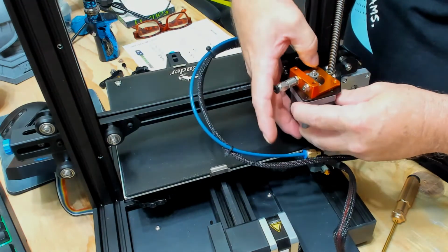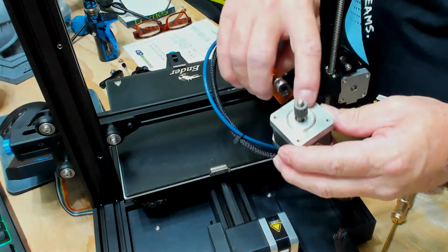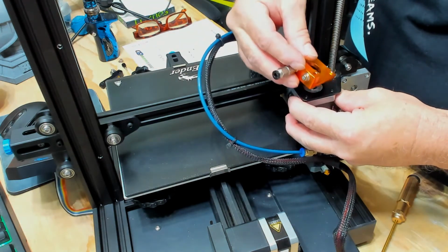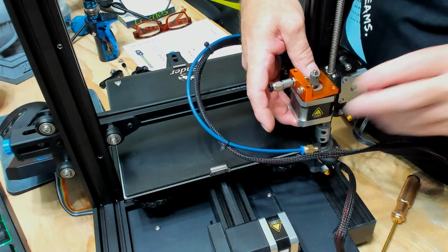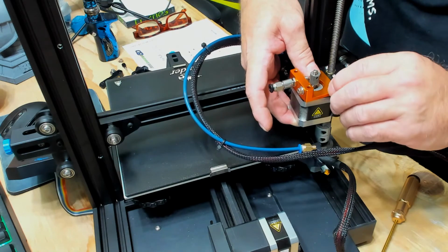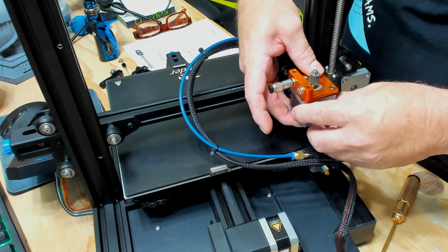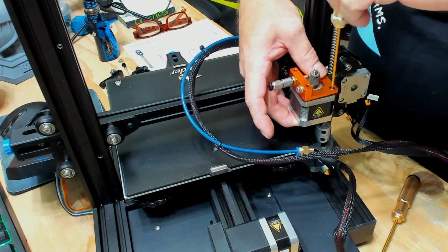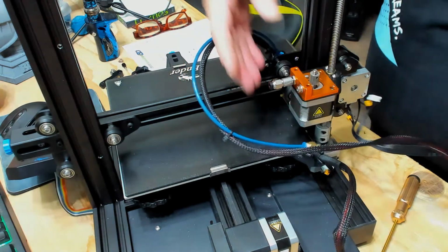Hold the motor back up in place. The stepper motor, as you can see there, around the center motor shaft, that's raised area there, it looks like a washer. That will go right in place and sit there. And you can just hold it in place. And you can line your holes up to put your first screw in, which is an M3 black screw. And just snug it up. Get the other bolts fit in.